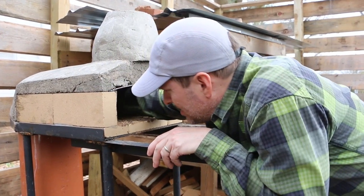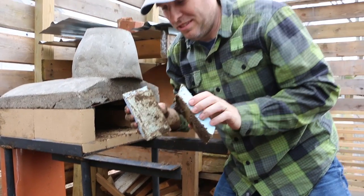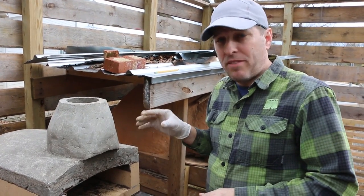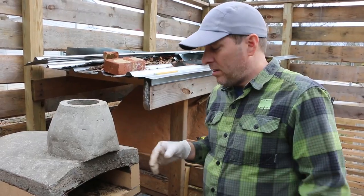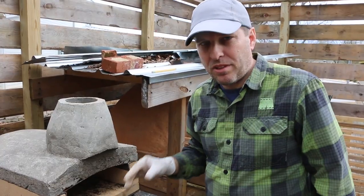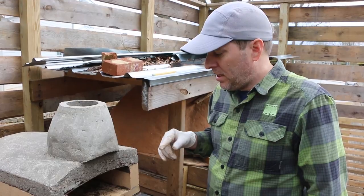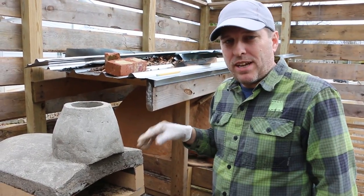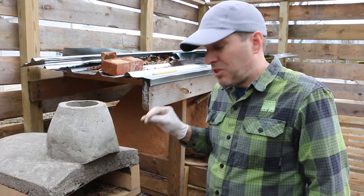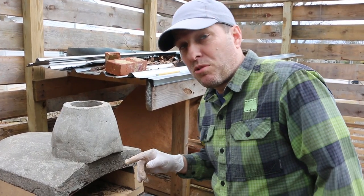I feel like a large animal vet right about now. Twins! Now that I have access to the top of the mineral wool, got my glove back on, I'm going to get in there and see if I can release it from the top — from the stove mortar that was holding it in place. I don't think it was holding it in place very well, so that's actually in our favor. Also, the sand was still moist, which has probably kept the stove mortar a little bit soft.